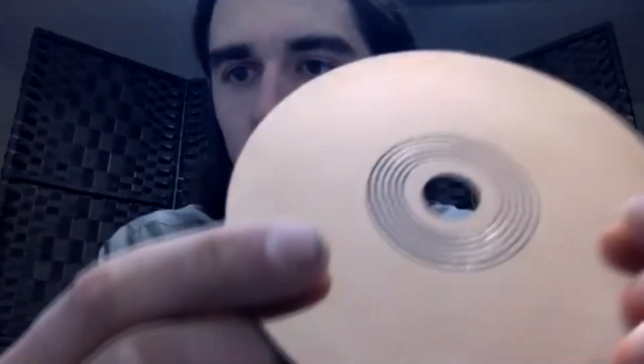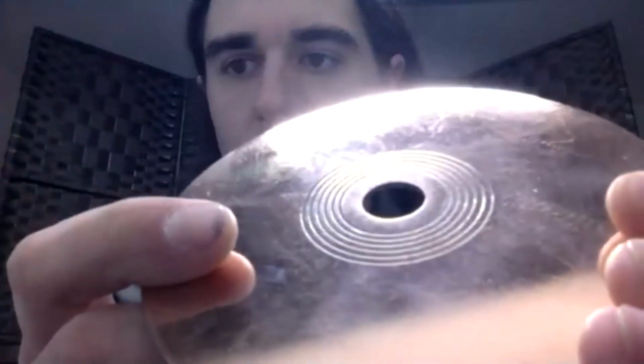So to replace this in the new version, we're replicating something a lot closer to what Richard actually did. In that case, we're using a printed circuit board that has several rings cut on the inside. The reason these isolating rings are placed there is so that we can solder and place low leakage diodes to further isolate charges. Once they reach the outside periphery, the large copper surface where the electric field component is the greatest, we can't allow charges to enter back into the hub. Even though the tube is isolated, this is just an extra step.